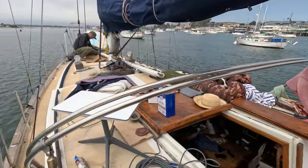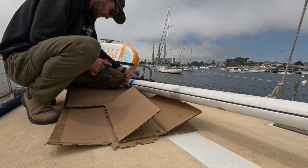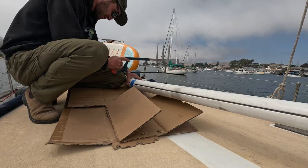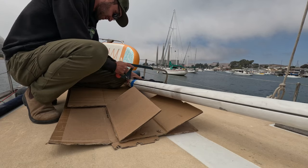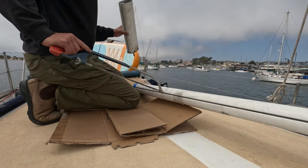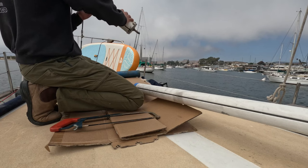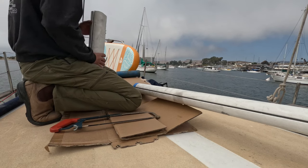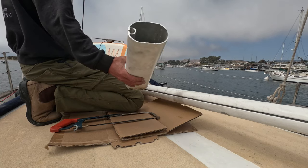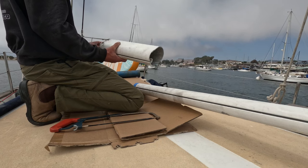Let's take a look. Grant decided to shorten the staysail boom because he raised the tack point on the forestay, so we had more room for the dinghy underneath. Plus the sail, we have had a 24-inch pennant to allow for the sail to sit high enough at the clew. So moving the tack of the boom up did change where we already were hoisting the sail to. He had to cut it because raising it made it hit the mast. Staysail boom, 15 inches shorter.